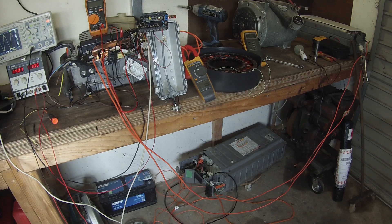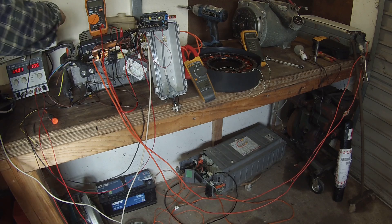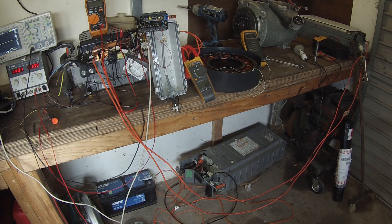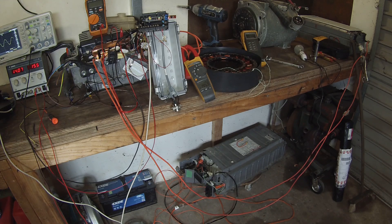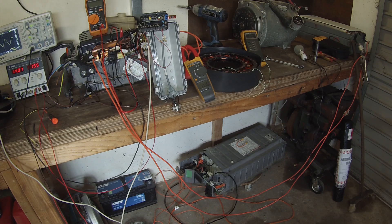Let's see what we get this time. There's 200 amps again. Let's put our scope back on and see if we are actually generating sine waves at that. Let's go around 5 volts per division — yes we are, we're generating a sine wave at 195 amps. I think we're maxed out on voltage.